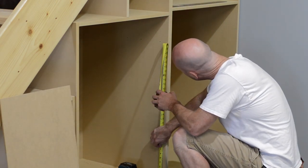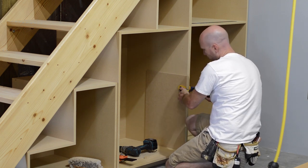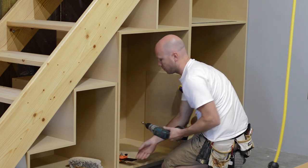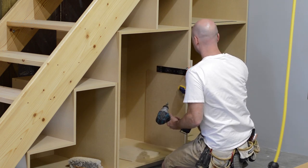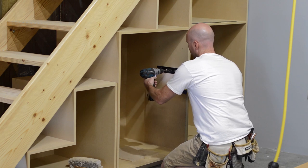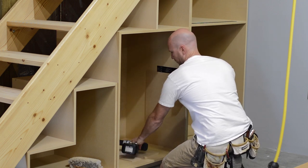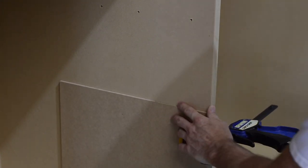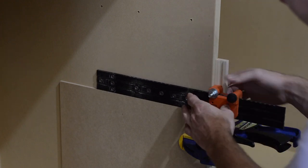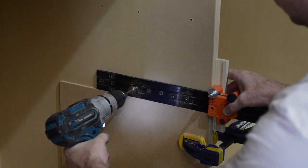After the highest series of holes has been drilled, I measure, cut the template down, and drill the next series of holes, and so on. The one downside to this jig is it's too short, so you can only drill about halfway into a 24-inch deep cabinet. Sometimes you'll have to come back and add a screw towards the back of the drawer slide after installing them — but at least at that point the drawer slide is positioned perfectly and you're just adding a screw for reinforcement.